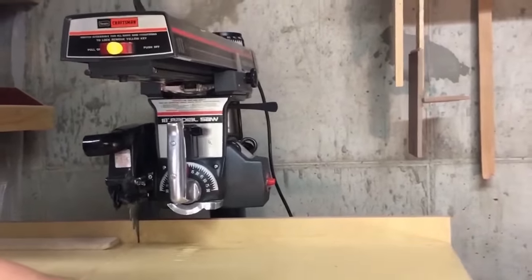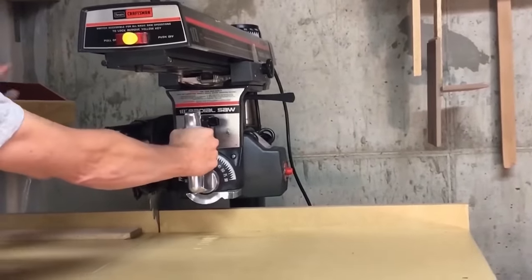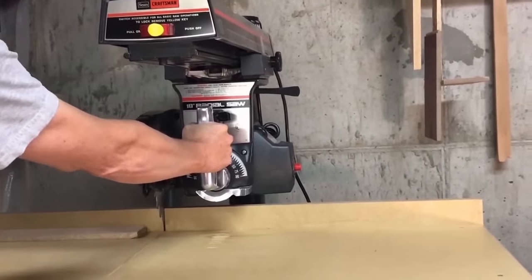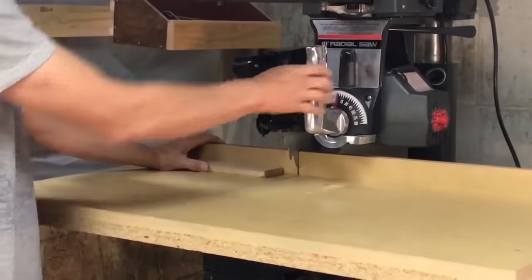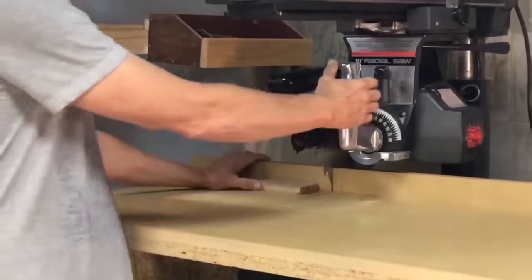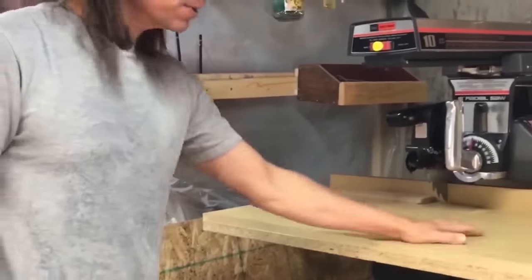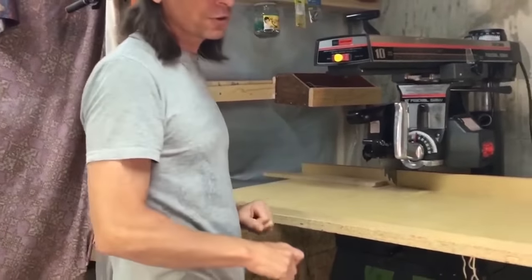When the saw is turned on in any of the cross-cut positions, one hand should be on the handle and the other should be holding down the workpiece. Or if the workpiece is clamped, that hand should be on the side of the table or in a safety zone. The free hand — the one not holding the handle — should always be at least six inches from the blade. Never cross your arms as you pull the saw through. Also, keep your work area clean, both the tabletop and the floor, especially because you do not want to fall into the saw if you trip.